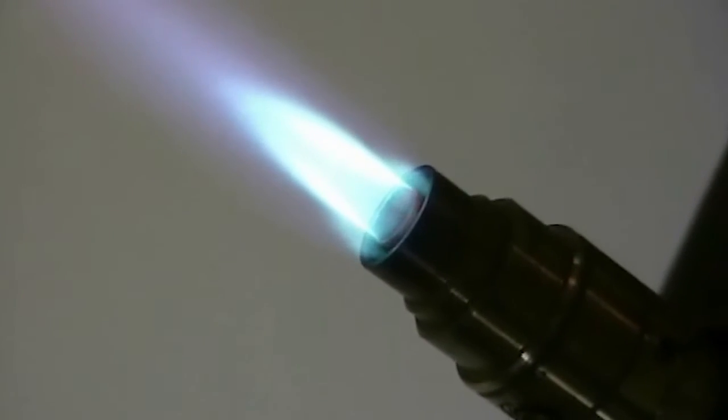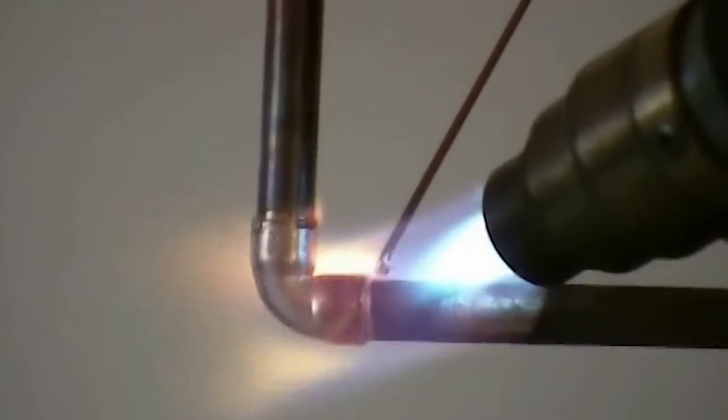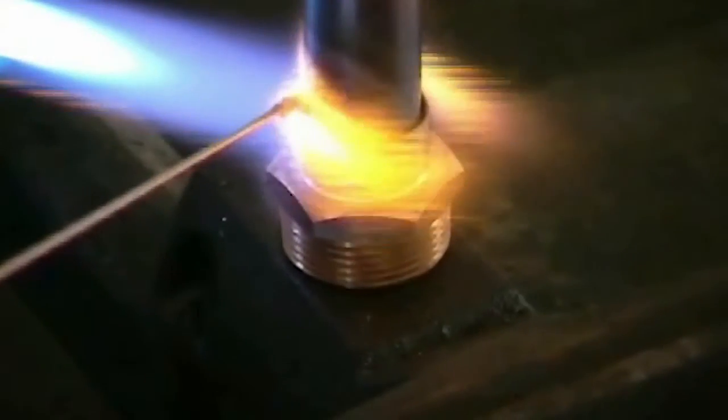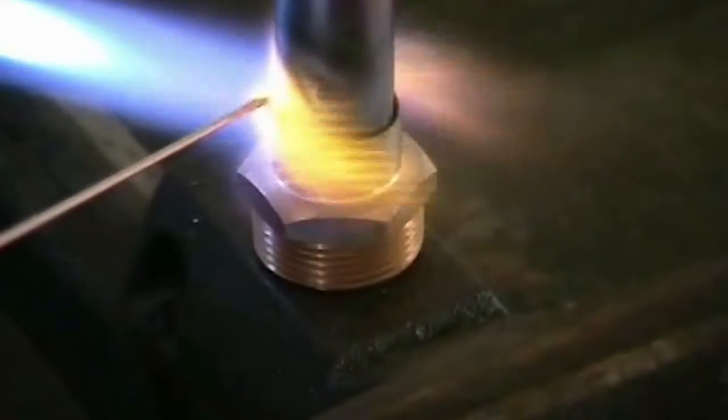This tool can be used at home, in the workshop, or on a construction site. Large diameters do not frighten it. A 40mm copper socket would be copper phosphorous brazed in a jiffy. A brass sleeve and a 28mm tube don't even stop the OnlyGas Heat Gun Torch. A few seconds later, the operation is completed.